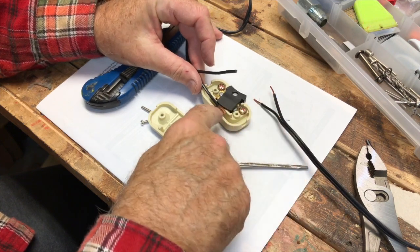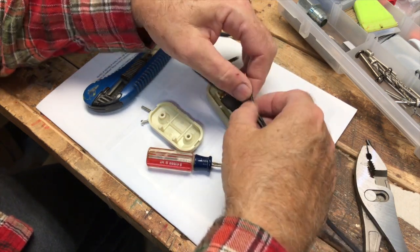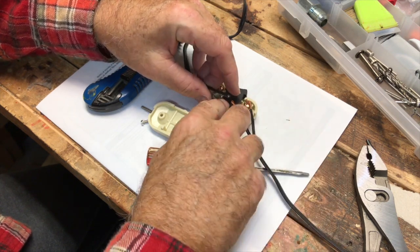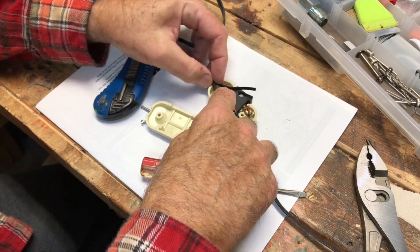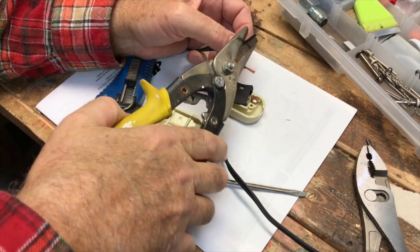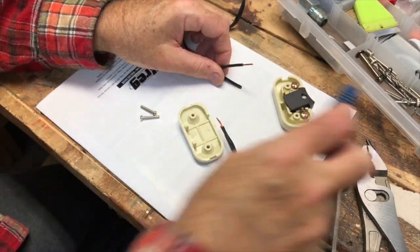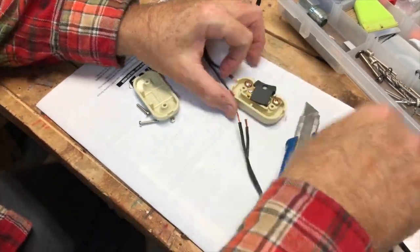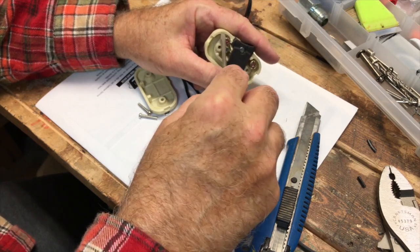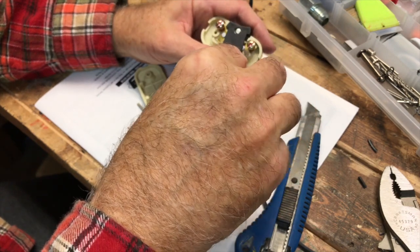Here's what I want to do — I want my seam for the two lines to be on this side over here. This will be wrapped with electrical tape there, and this will go around that end. For this side it's a bit long for what I need, so I'll cut that down to make my connection. It's important when you lay your wire in here that you lay it in the same direction that you tighten the screws.